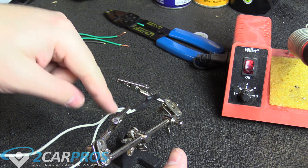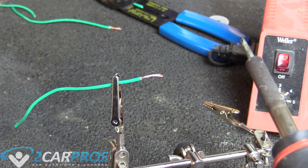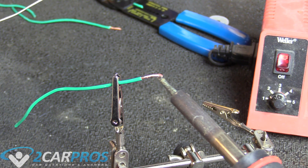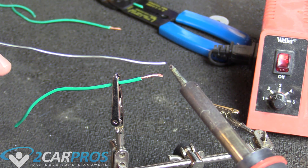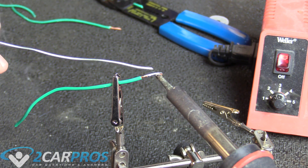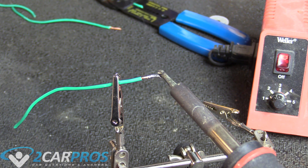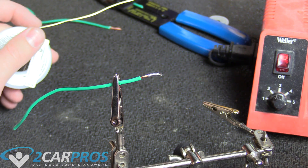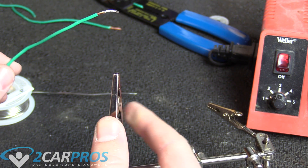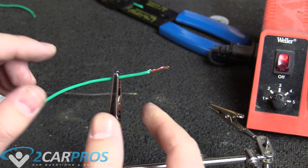Now that I've shown you the way I don't like, I'll show you the way I prefer and think is correct. This is the beginning of how you should solder two wires together. We have one of the wires here, and I've twisted it together so that way it creates a nice flat working surface with nothing poking out in any direction. We want to tin the top of the soldering iron and then just apply it to our wire — you don't need a ton. I see a lot of videos where people put just a huge amount of solder; you don't need that much. That is looking rather nice — that's really what you're going for. Not a ton of solder.